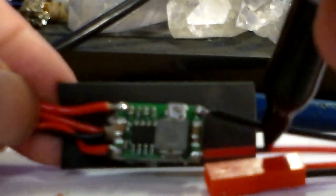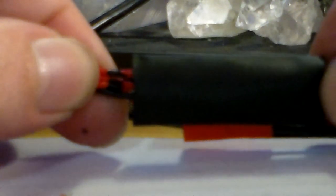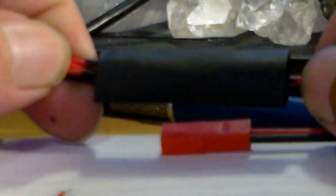our marker, and we're going to mark the wires just a little bit further than the shrink tubing is. Okay, so I'm going to mark over here on these wires too, about at that point. Okay, about there. And this is so that when we put the shrink tubing on, we'll try to put it between those two marks, so it'll be nice and centered. Okay, so I'm gonna take that and put it on there and bring it back over here, put it back on, make sure that my wire thing on the back fits inside there. Okay, and I'm gonna push it till it gets to the black mark, and I see the black mark over here on this other wire.